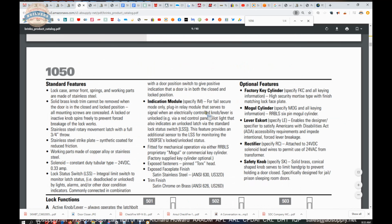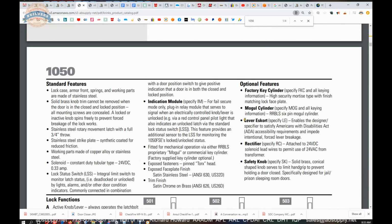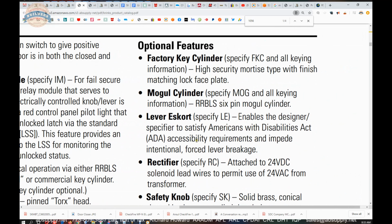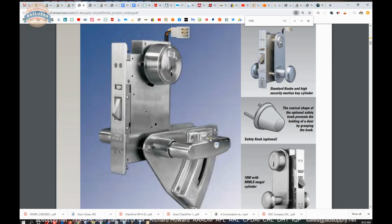And we can look in that series, and there is a link below this video to the document, but the lever Eskort, specify LE, enables the designer or specifier to satisfy the ADA accessibility requirement and impede intentional forced lever breakage. So what they're saying there is, if this was a standard mortise lock with just a lever hanging off, you'd be able to absolutely use that lever as a handle or means by which to damage the lock itself.